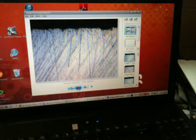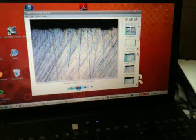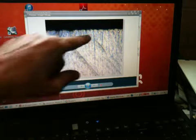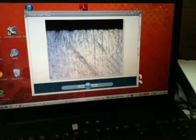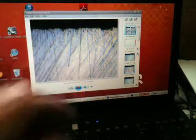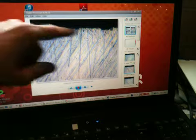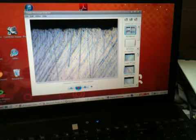Not quite there yet, and I think this is what you're experiencing. The more time you spend on the stone, the more refined the edge gets. And as far as comparison to one of my stones, yours is about maybe half as efficient. And also, if you look at the Japanese natural, here, this is from before, there's a minor rogue scratch there, but that's about it. There aren't that many. These are, because I was sharpening straight on, edge straight 90 degrees to the stone. These are representational scratches of rogue scratches from grit particles from your stone.